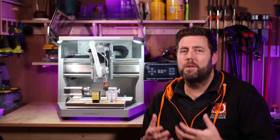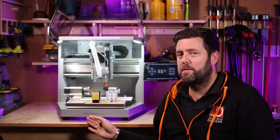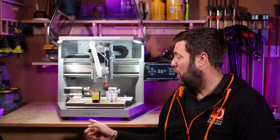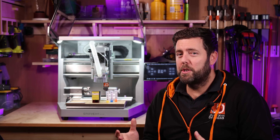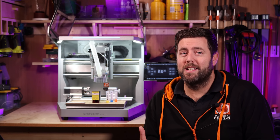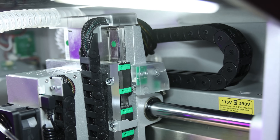Going back to the Kickstarter campaign, one reason for it was for people like myself to identify issues in the original machine before it goes into production. One of those was the amount of dust falling through the gaps underneath the bed, leaving a lot of debris in that space. They have tried to improve this by adding dust strips where the machine runs. It still needs the gaps because it runs on those rails, but it has minimised the amount of debris falling underneath. They have also taken on feedback about the exposed limit switches. When machining metal, one chip landing on a limit switch board can give a false alarm and pause or potentially ruin a job. It is great to see they have enclosed and encapsulated all of the limit switches, minimising the amount of debris that can reach them.